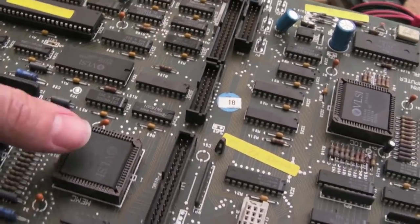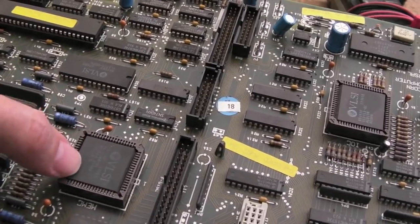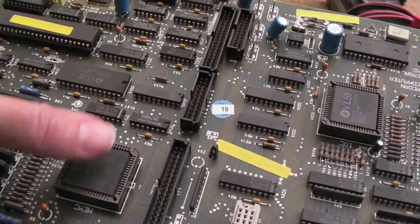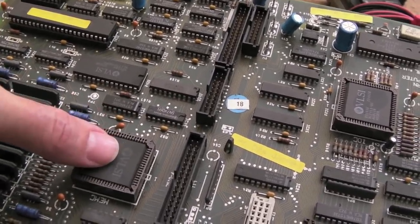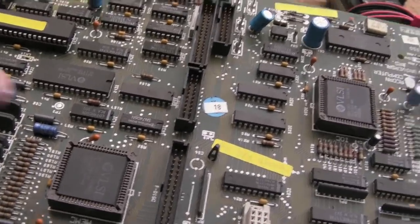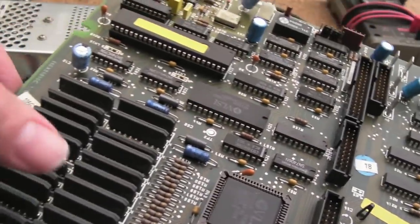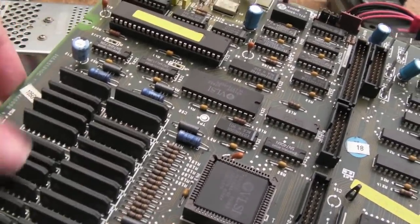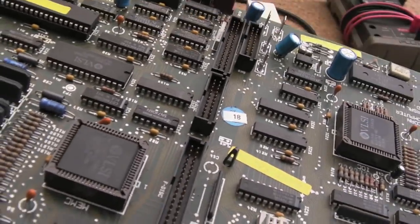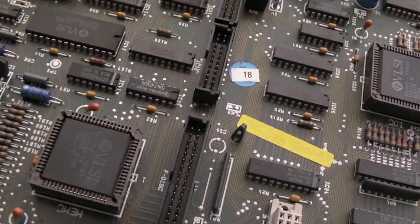From what I was reading about upgrading the RAM beyond 4MB — Acorn designed it so you'd need to link up more memory controllers. You can have four MEMC chips communicating together to give up to a theoretical 16MB. Some earlier versions are limited to 1MB, and there was an earlier version of this memory controller that was a bit flaky — I can't remember exactly what was wrong with it.